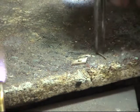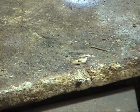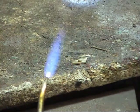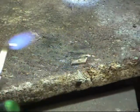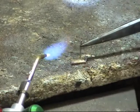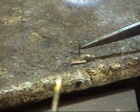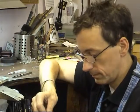And here's a very quick way of soldering — you don't need to use the borax this time. The same principles apply. I'll just heat up this main part first, and when the solder and the flux starts to move around, I'll introduce the post. And that's it — it's as simple as that. It really is that quick and that easy.